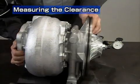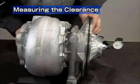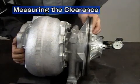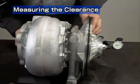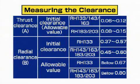Now measure the thrust clearance and the radial clearance of the turbine rotor. Measure in the same way as in disassembly. Check that the measurements are within the allowable range and enter the results on the record sheet. If the results deviate from the allowable range, reassemble again, keeping in mind the clearance values during disassembly.